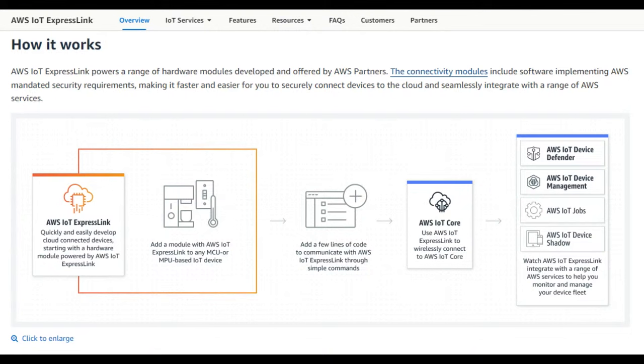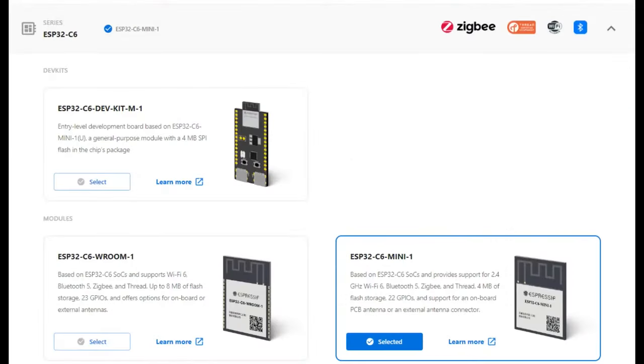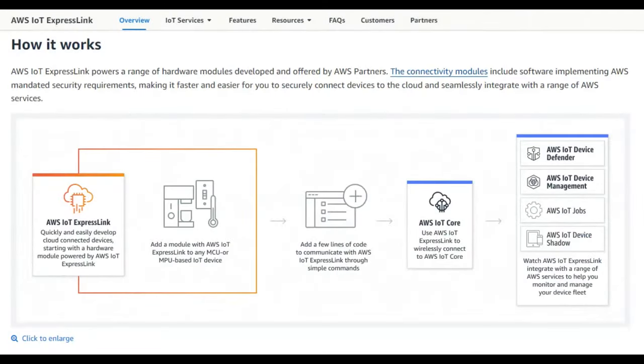What you can do is use their two-chip solution called IoT Express Link. Basically, you program the ESP32-C6 as your Wi-Fi/Bluetooth/Zigbee Matter device, and then you can communicate to it via another microcontroller — say your SAMD21, Renesas, or Raspberry Pi. One of the nice things is it also has a direct channel to send data to AWS IoT backend, so you can use all the AWS IoT capabilities they've developed, which is kind of neat. You will need an AWS account and pay for the services.